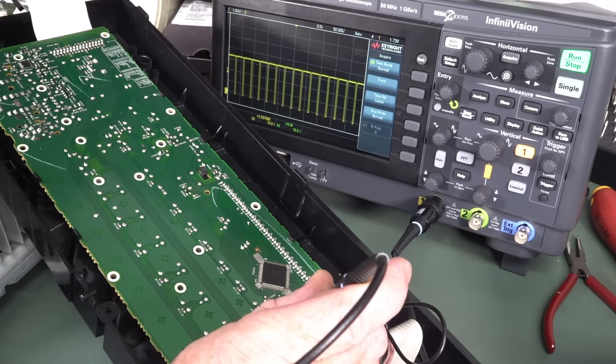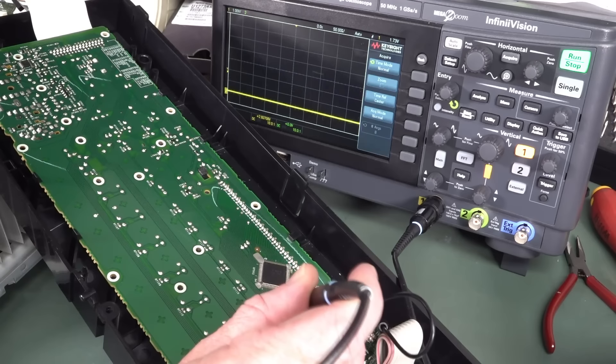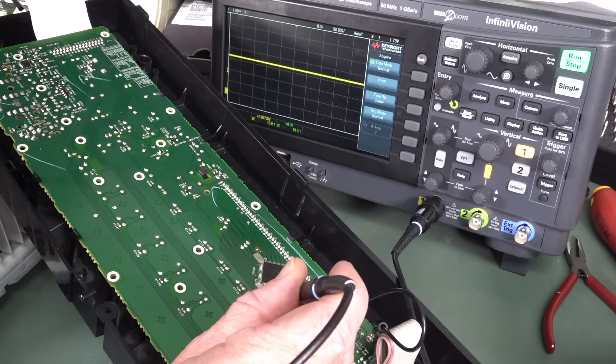So what I've done is I've measured all the caps on there. I've made sure there are no shorts anywhere. Everything looks fine. The diodes measure fine. Everything's hunky-dory. So the next thing to do is check that the chip's actually getting signals to it. There are a couple of resistors down here — on one side, that's some sort of clock signal. On the other side of the resistor, just to make sure it's not being loaded down — no. Yeah, that's like data. That's data. Looks like data again. Yep — looks good. And the other one's just a reset, and that's permanently high — I believe that is correct. So it's not reset. So chip's getting data, but it's not displaying anything.